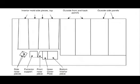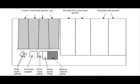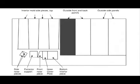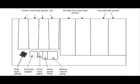The first step in building a biosand filter mold is to cut the metal pieces to the appropriate size. First, you will need to cut your 3 millimeter thick steel plate. You will need to cut it into several pieces. The pieces you will be making are 4 interior side pieces, 1 bottom inside piece, 1 extractor support piece, 2 exterior side pieces, 1 exterior front piece, 1 exterior back piece, 2 side nose pieces, 1 front nose piece, and 1 nose cover plate piece.